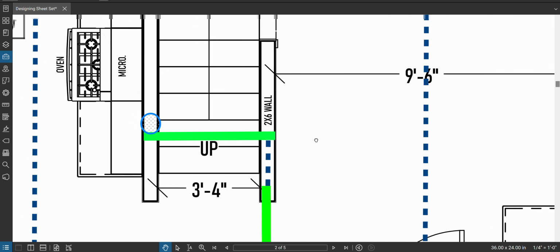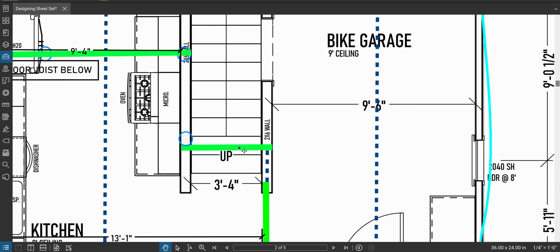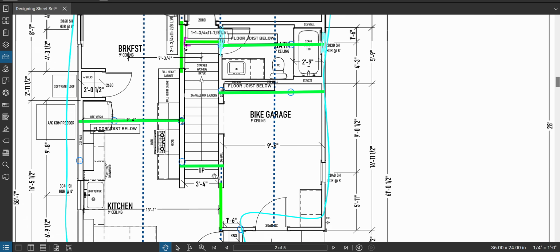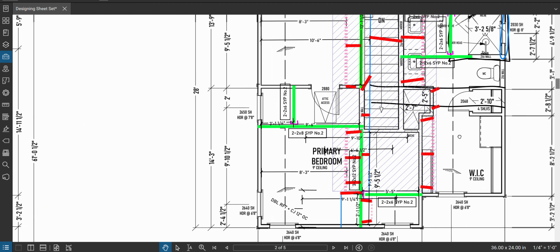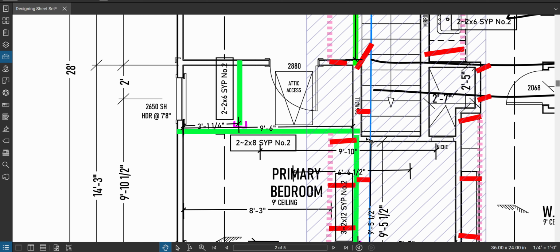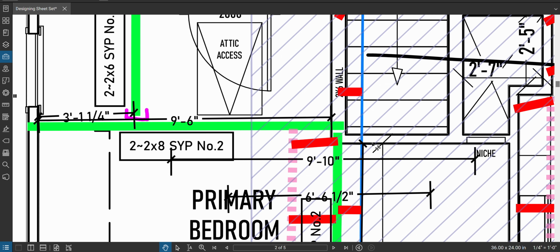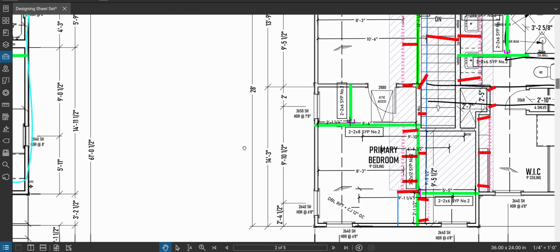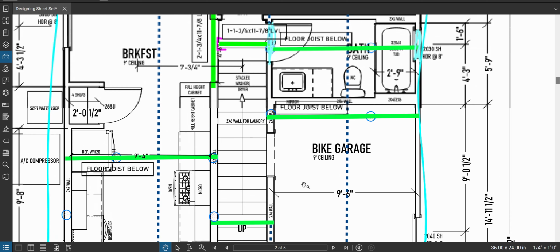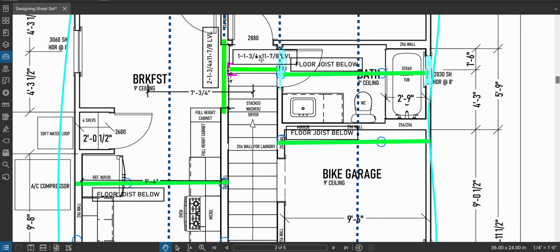Okay, so this beam, this is the same premise. This is making the backside of the stairway, the backside of the floor above the stairway. It's holding this wall, and this wall doesn't look like it has anything on top of it. Literally nothing is on top of this. Ceiling is running left to right. The roof is bracing to everything else around this, but there's no weight on this. So there's only dead weight of the wall. And this is a short, tiny span. So I'd be just totally fine if I did the same one LVL thing here.